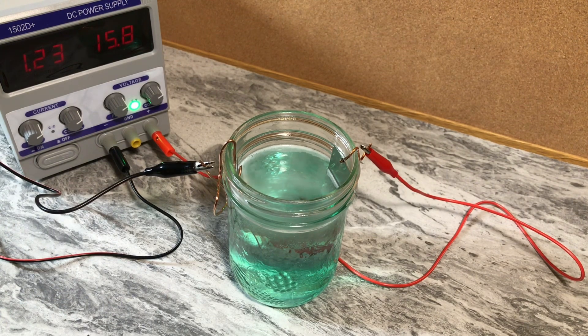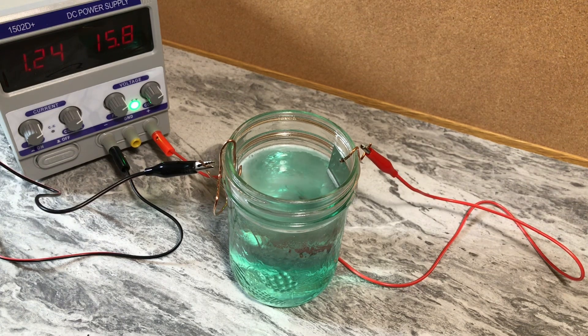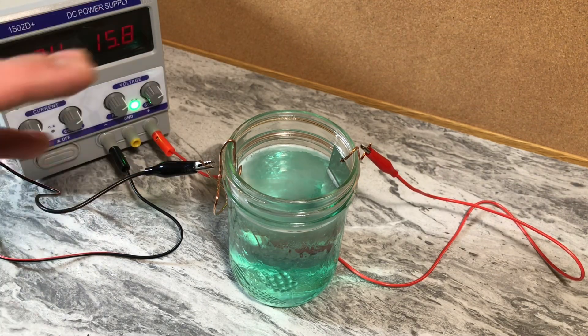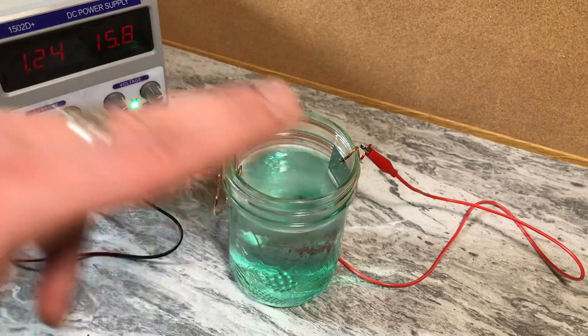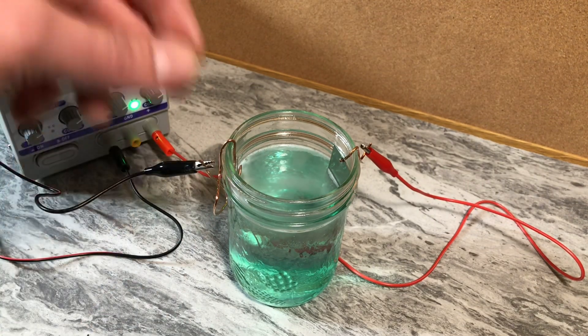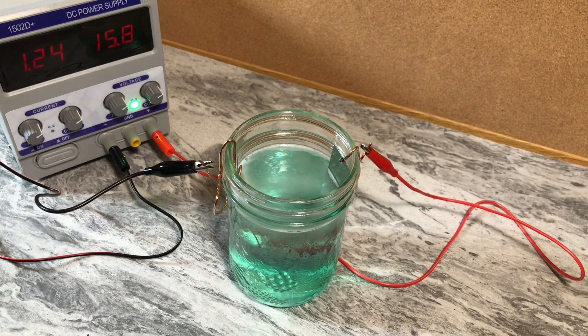Another reason you want to make the solution properly is that if you don't, that's how you get bad lines on the things you're plating. A buddy of mine just dunked his piece without making a proper solution and it came out with lines all over it. You want a deep, concentrated nickel solution — it takes a lot of time off your plating and makes the results much better. Also, when I pull the anode and cathode out you'll see black specks in the solution — that's pieces transferring between plates. You'll need to filter the solution to remove those chunks.